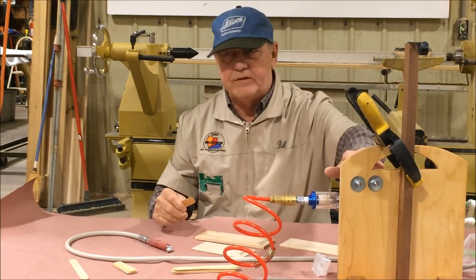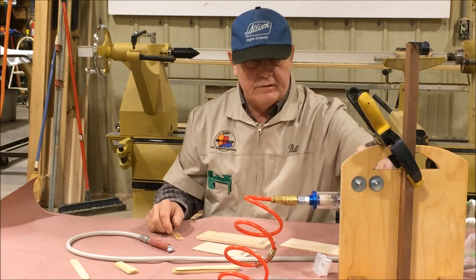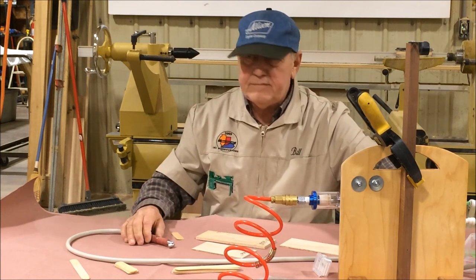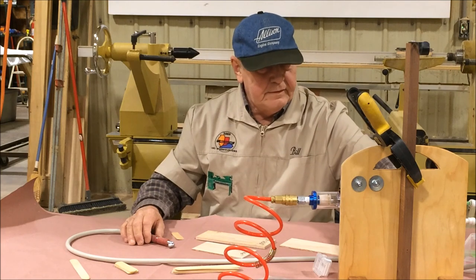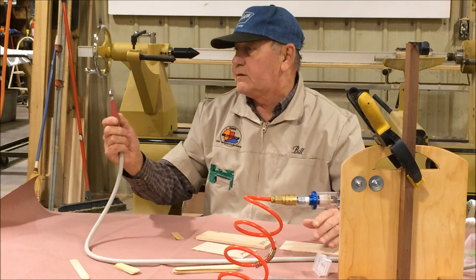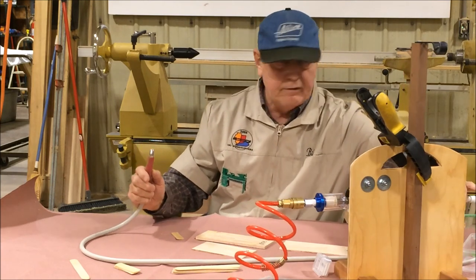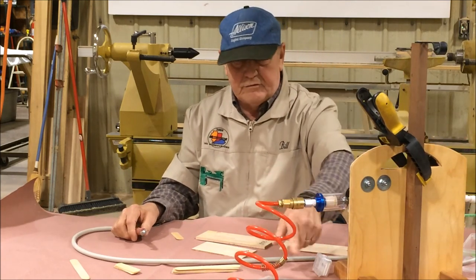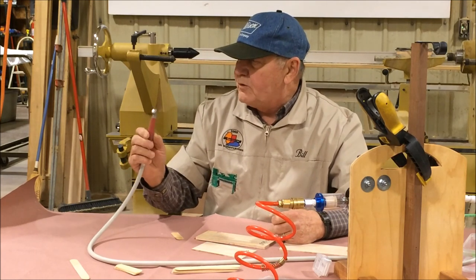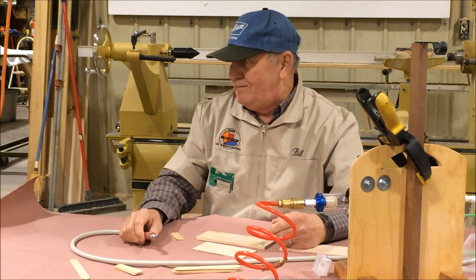The first thing I'm going to do, I backed off this compressor, and I'm going to turn off my bleed air. And I'm going to turn my valve on, bring it up to 35, and then get me some bleed air and see how much I drop, and then bring this back up to 36. Because I know with the bleed air, 36 is my maximum pressure for the turbine. But with my bleed air, I'm going to be under that, even though my gauge is going to say 36 here. This is why you need a secondary gauge. You can never do it off air. I don't know how these things overspeed. I worked in the aircraft industry, and you don't want to overspeed on one of them. I can tell you, they go boom. I've seen it.